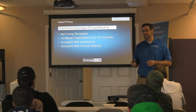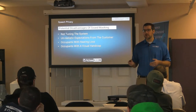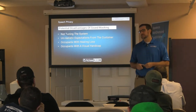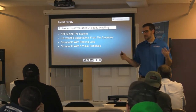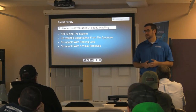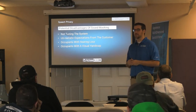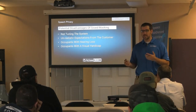People with hearing loss — if you make it louder and you've got people that can't hear already, that's a problem. Talking to your customer up front: do you have anybody with a hearing impairment? There are a lot of reasons people lose their hearing — not wearing headphones at the gun range, working in an engine plant, just getting old. Adding sound masking is going to make their life more difficult, especially in an emergency. If someone's got an emergency page and they can't hear it, that's bad. People with a visual handicap who rely on their hearing to tell them what to do — if you make it louder for them, you've also got a problem. The Americans with Disabilities Act entitles everyone to have access to the same information in the workplace, so sound masking may not be the best option in those cases.